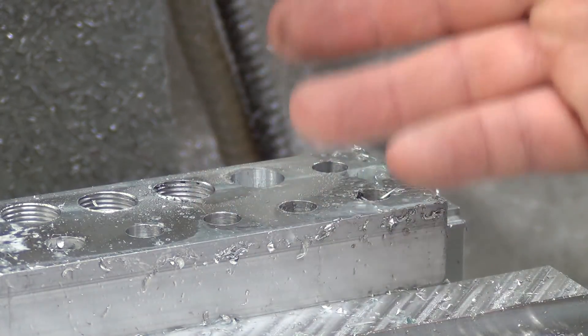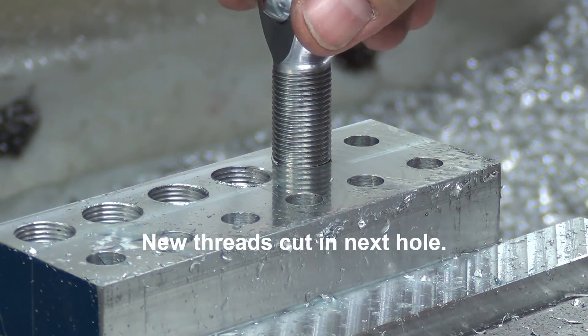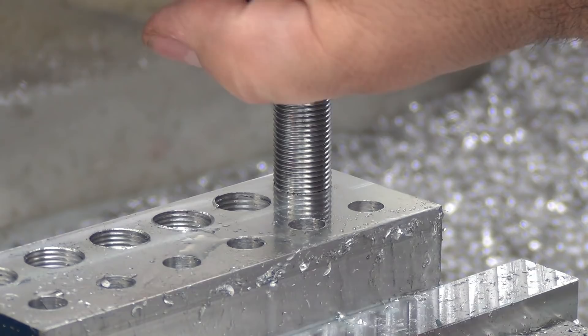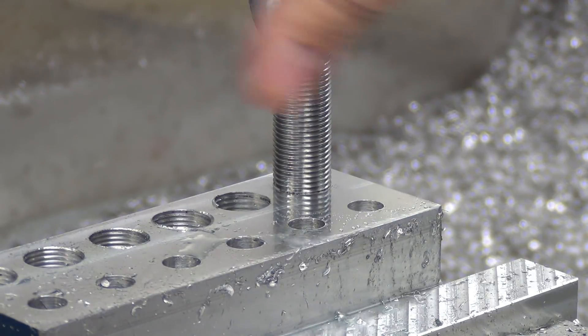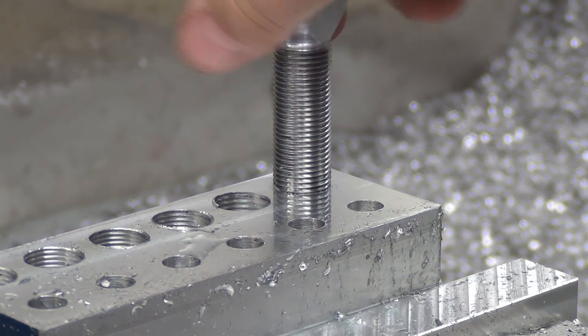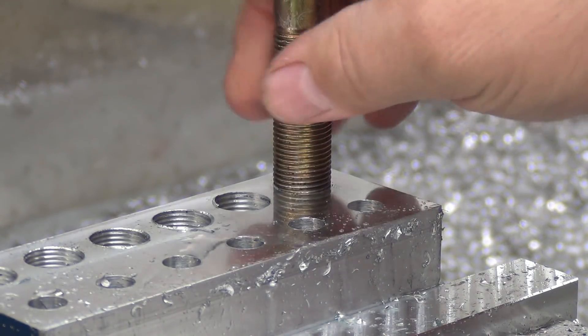I'm changing more than one thing at a time which is taboo, but okay — that's in the bottom of the hole and it's just loose. Yeah, it was the thread pitch that was wrong to start with. I put the numbers back to where they were and I've got a really pretty tight thread here, so I'm going to have to loosen it up a hair because in aluminum that's a little too tight. I'll compare it with another bolt.